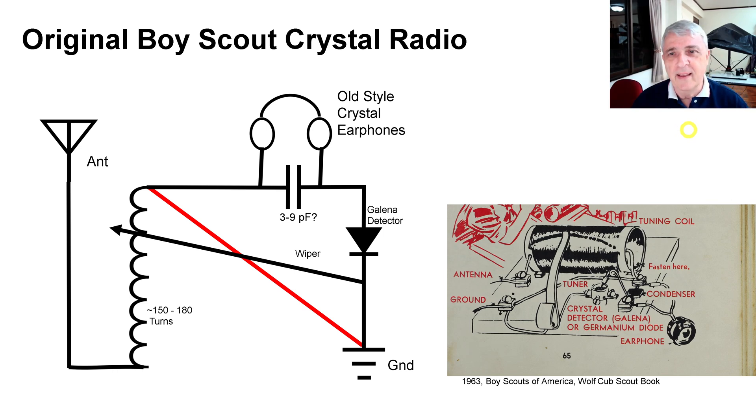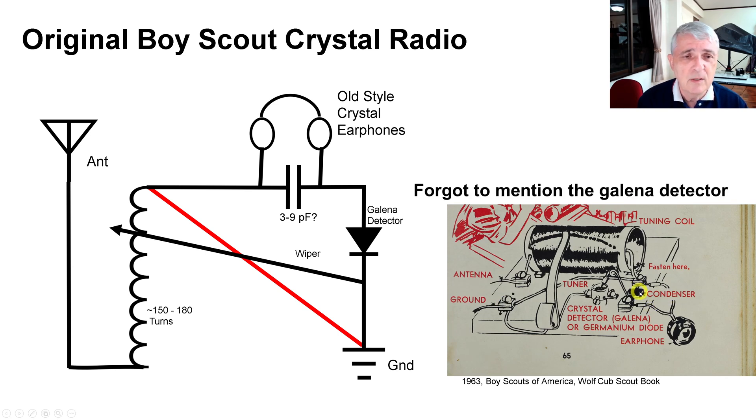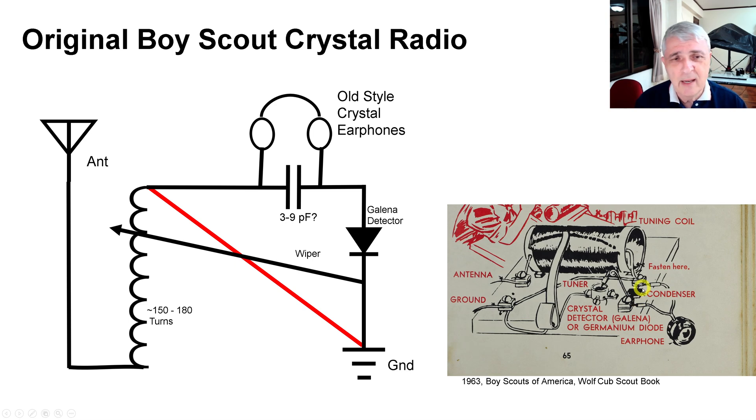Let's go over why I'm making this video. The reason is because the page from the book — this is an actual page from the book — this is what I built mine from. In fact, my original one looks remarkably like this. So it's a toilet paper tube, the windings, a piece of flat metal — I think I used brass at the time — some washers, and I made my own condenser per their instructions. This is an old-style earphone, which is why you need the condenser; the new ones you need a resistor. That's not the modification I'm talking about today. That modification has to do with this wire right there.